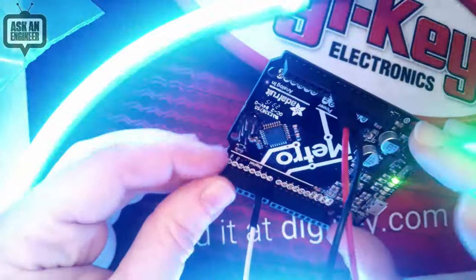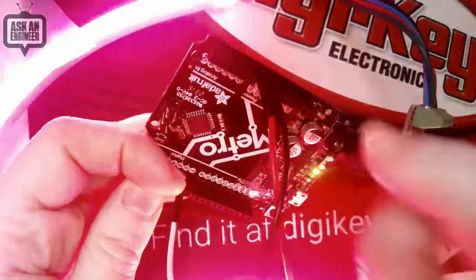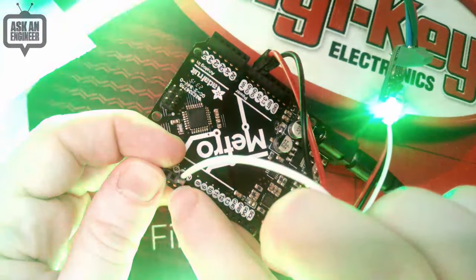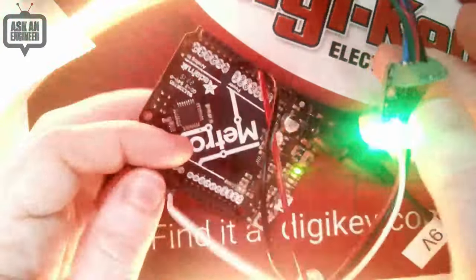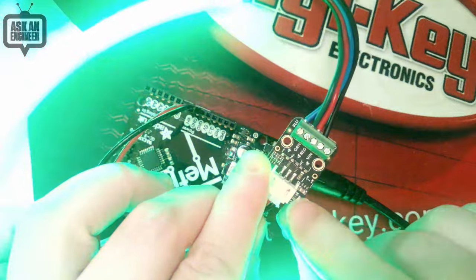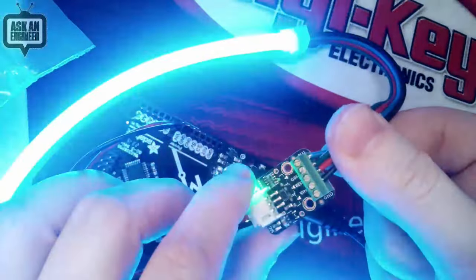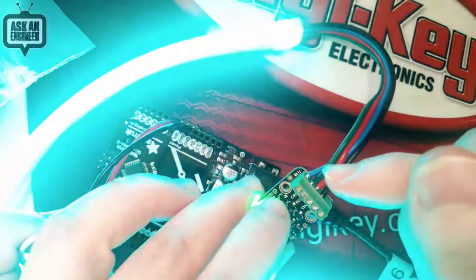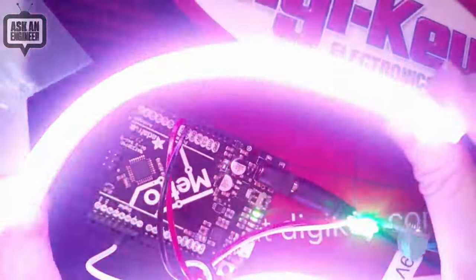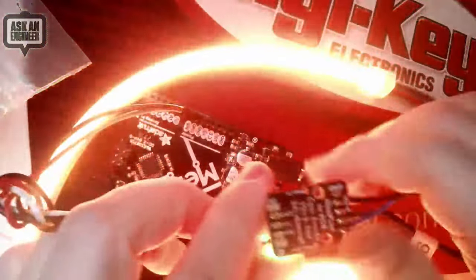Here's a demo on overhead using a Metro 328 Arduino-compatible board. I'm powering it from nine volts — connecting the red wire to VIN on the STEMMA board, ground to ground, and the NeoPixel signal to pin 6. It thinks it's connected to a single NeoPixel. There's a power indicator LED and a signal LED blinking, and you use the terminal screw block to connect red, green, blue, and the black wire for 12-volt power. It's doing the NeoPixel swirl.